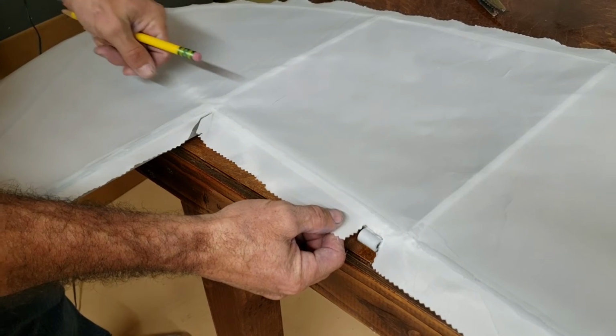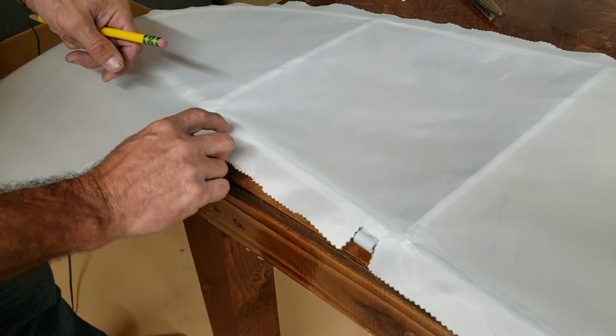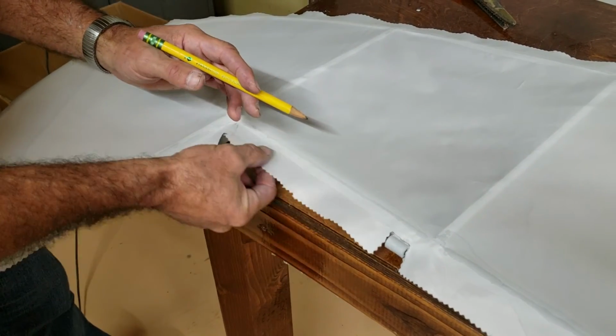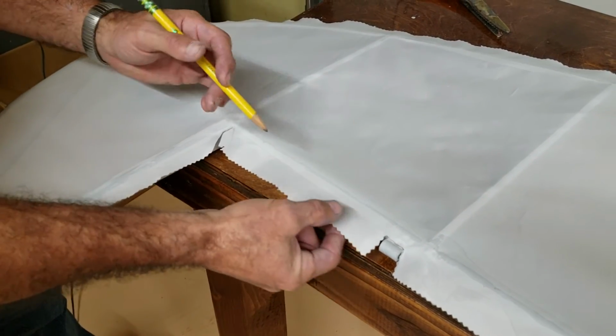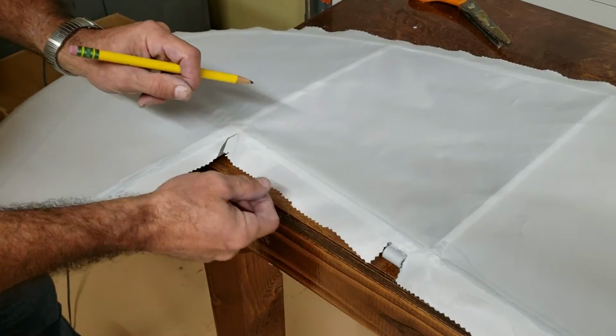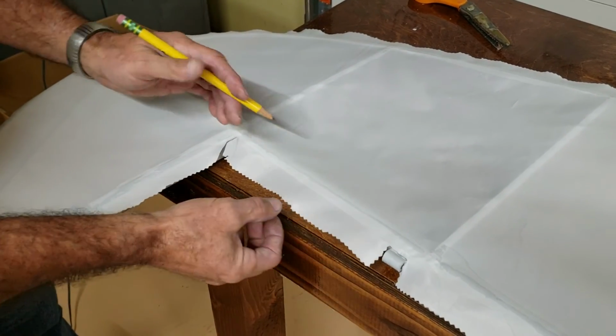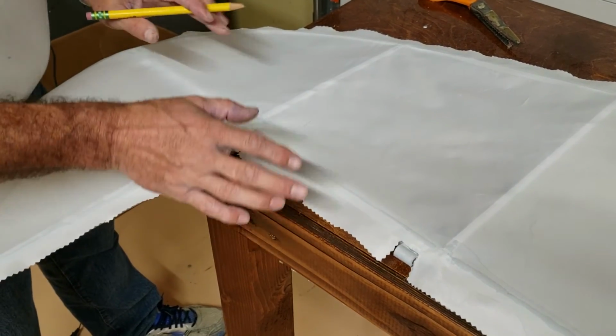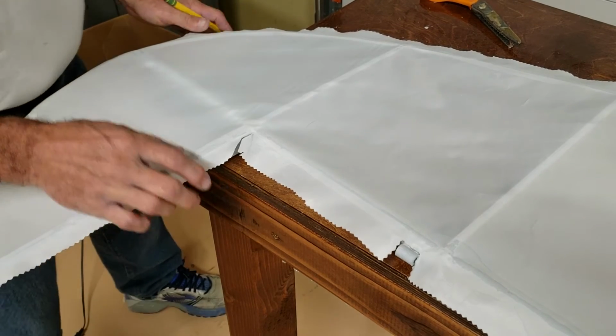Then you can take a razor and cut the fabric where you have wetted that down and it's dry, and it won't fray near as bad where it has been wetted before and it's already dry. So in a place where you need to cut a straight edge with a razor, you can wet that fabric with thin glue, let it dry, and cut it. It will still fray if you really mess with it, but it kind of holds and sets that fabric.